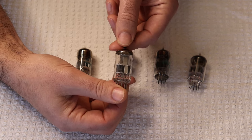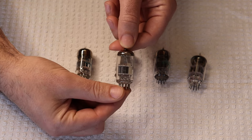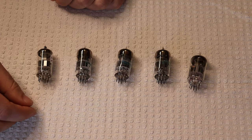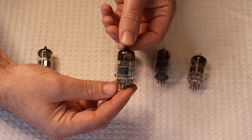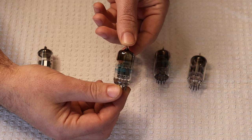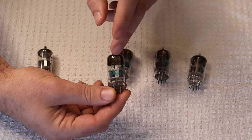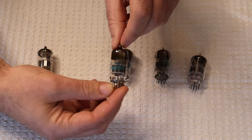The good news is that Sylvania made some wonderful 6DJ8 types. Later on, Philips actually bought Sylvania and all global production was essentially coming out of the Sylvania plant under the Philips name. Here we have a Sylvania standard 6DJ8 type. The plate structure is very similar — all these tubes have almost the exact same plate structure. This one is labeled Philips ECG, after Philips purchased Sylvania. They commonly have these off-blue, teal, or green labels, and they're easy to recognize that way.